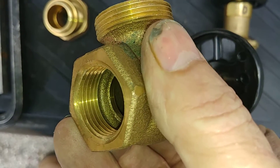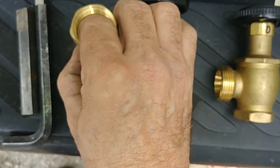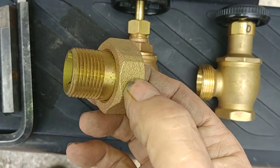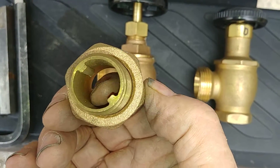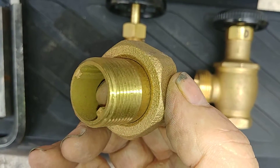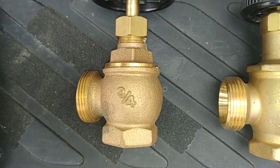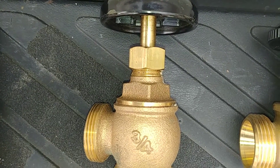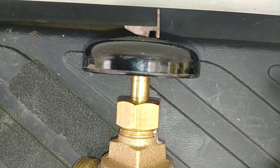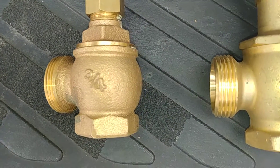Typical three-quarter inch female threads, standard. And I have the spud example, which has the three-quarter inch male threads, which goes into the fitting in the radiator, usually using these lugs. Get a radiator spud installer — you can see the finish is rough but serviceable. The packing is standard packing, Teflon seal underneath. The cap is a hardened sort of phenolic resin, very brittle but replaceable.